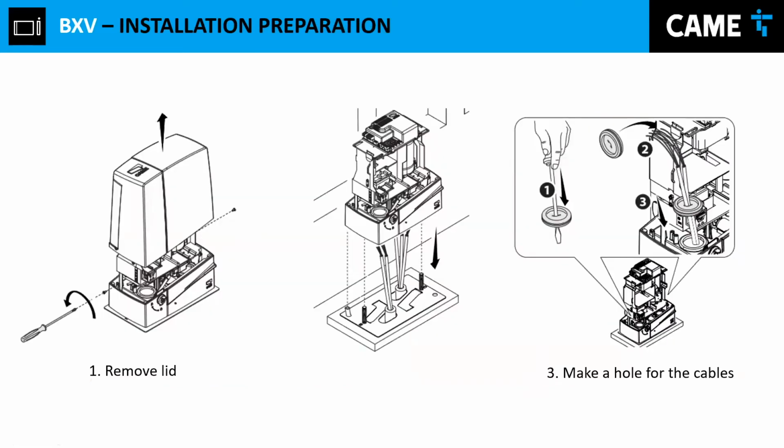In order to get ready for the installation, you have to remove the lid. You remove the lid, and you have 2 holes over here where you're going to be running your wires. However, something that I friendly advise, as I know over here, these 2 screws to remove the lid always get loose, always get lost. So my recommendation will be, you remove the screws, remove the lid, and then put the screws back into the holes. That way, when you're done, you don't have to be looking around for these screws, because more likely you're going to be losing them if you don't do that.